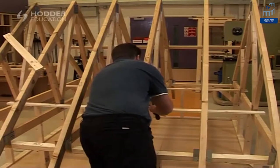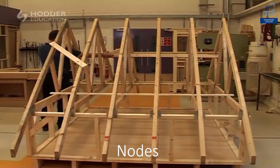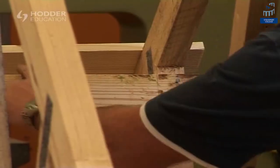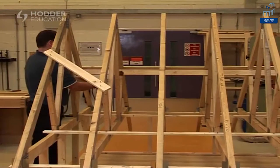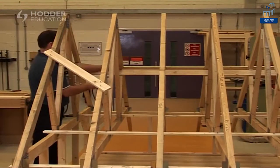These intersections are referred to as the nodes. The longitudinal bracing positioned just below the rafters should have a margin of approximately 25mm to allow for further diagonal bracing.